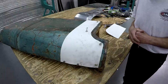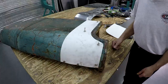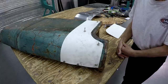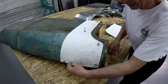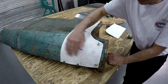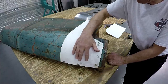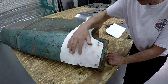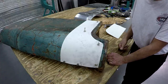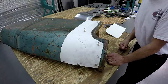You can use simple magnets to hold it or earth magnets which are stronger. Every time I do something like this I start with a paper layout — that's my starting point. This edge is a little long because of the slight convex curve of the cab corner, but I'm not worried about that now because it's so little — I can wheel that up later after I make the bead.